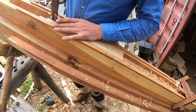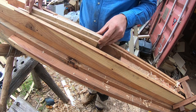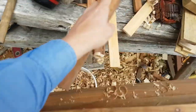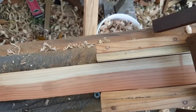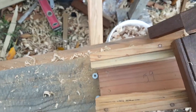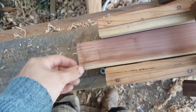Take the wedge out, take our pieces out. I had the 6mm strip in there, so if I take that out and replace it with the 9mm, we can take 3mm off the other side. Over time I'm going to get some more strips with different graduations so I've got a little bit more flexibility in the steps I take and don't have to make as big of jumps. That's how I get all my strips the same width.